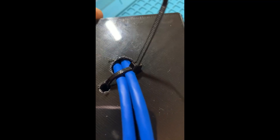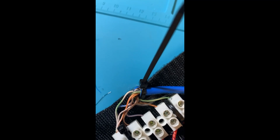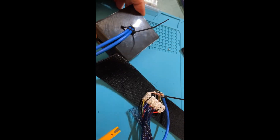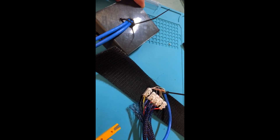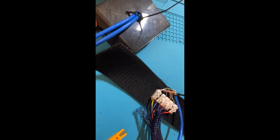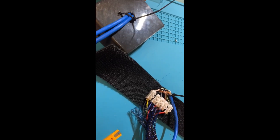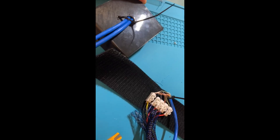I've got my Arduino in the box and the cable tie tied nice and snug for strain relief, because this is going to get caught on things and pulled. Here at the glove I've got the cable tie onto the sheath of the cable — under the sheath, not under the wires — and that's going to provide stability. When they hook the wire on things, it'll still do its job. And that is a glove construct based upon the PD buzz board single-controller Arduino Uno.